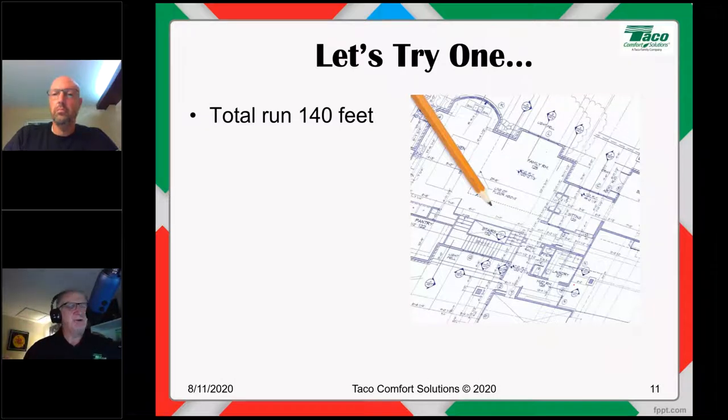Do we worry about the boiler? Well, hey, you know what? If it's a cast iron boiler, I just generally consider that a length of pipe, because the pressure loss through a cast iron boiler is way less than the pressure loss through a hunk of pipe of the same length. It's a big open space in the piping. You know, just don't worry about it.